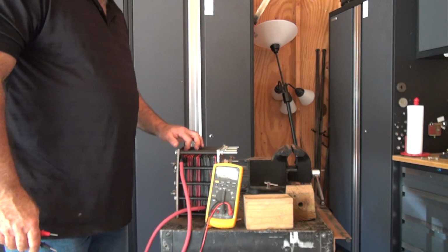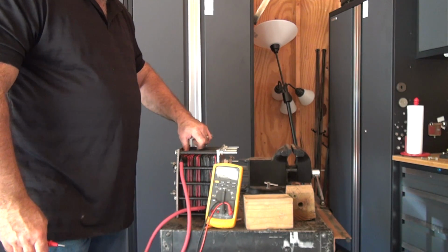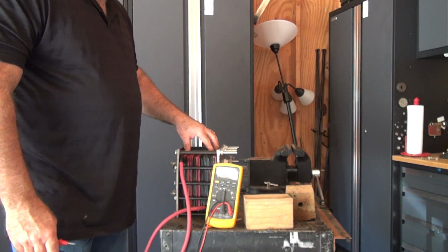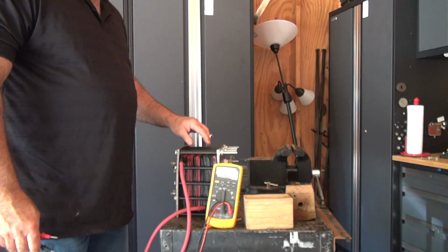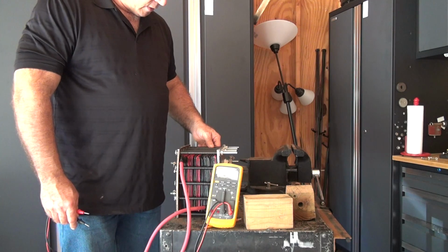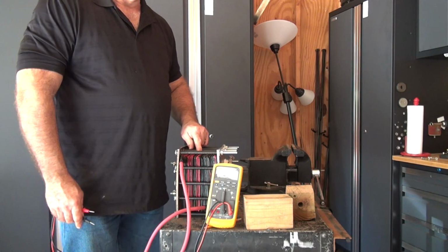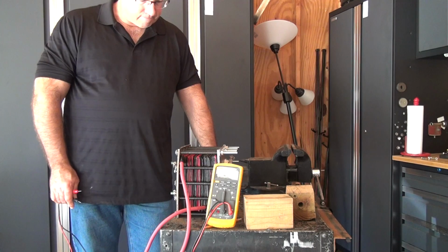I want the voltage to be dissipated through the plates from the one side, the plus side, to the negative side. 120 volts DC with the 60 neutral or 58 neutral plates. I had this problem the first time when I put it together, and so I put tape on the bolts to keep them from touching the sides. But that didn't seem to do it.